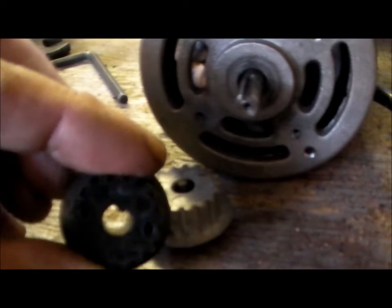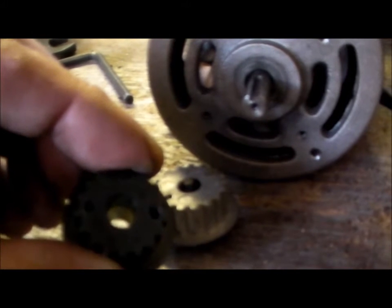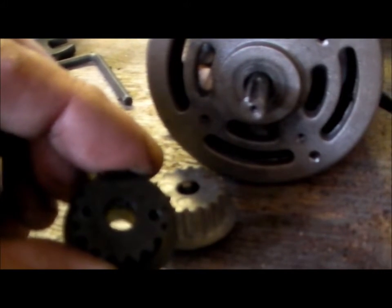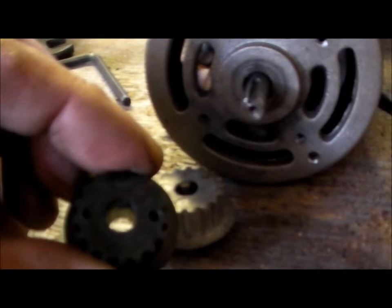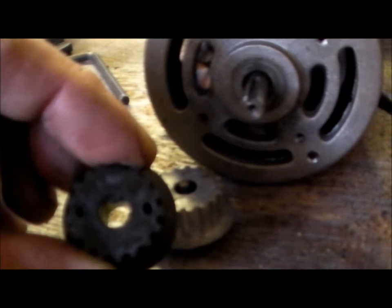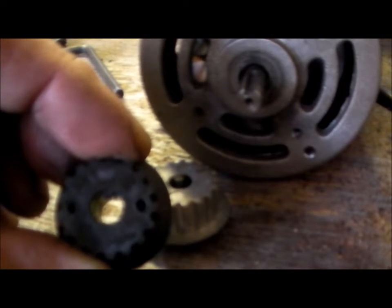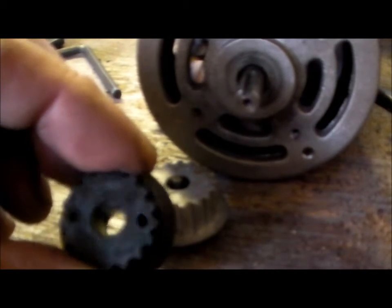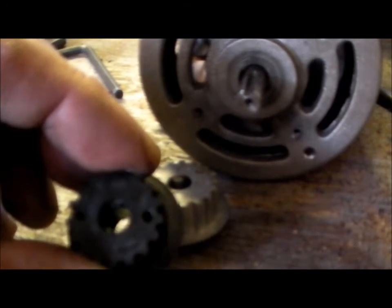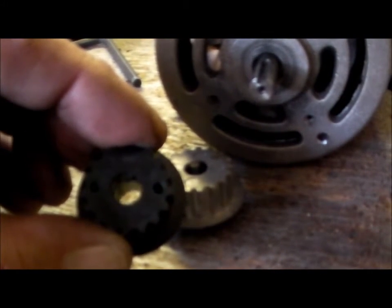This is the plastic gear. You might be able to see there's the tip of the keyway in it, but it had sheared off. This pulley was slipping on the shaft — although the fit to the shaft was fairly tight, it allowed it to spin up to speed without any problems. But of course, as soon as you loaded the spindle up by cutting something, the speed would drop off.